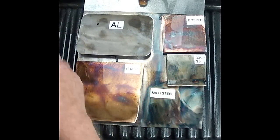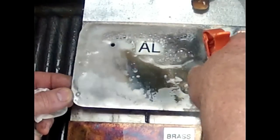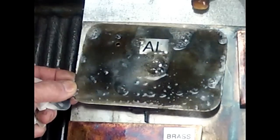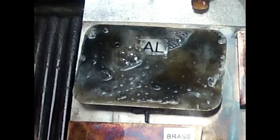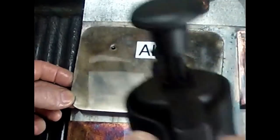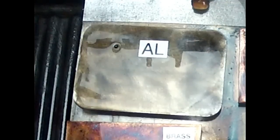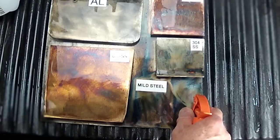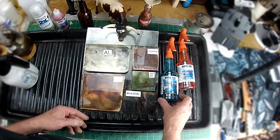You can see in the bottom right-hand corner that's just runoff from the stuff above. I'm trying not to give up on that aluminum, but it's a dying horse. Bubbles usually mean troubles, so be aware there is some off-gassing going on — I would suspect it's a release of hydrogen. There's some discoloration — some would call it a patina — but I think it's just dirty aluminum. I'm going back down to the mild steel, putting the activator on and then the Stainless FX, and it's really quite vivid what it did — pretty cool.